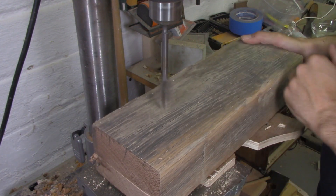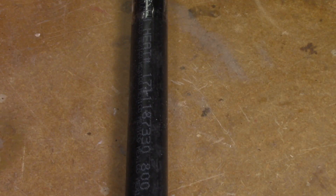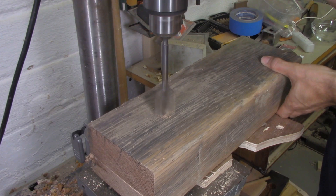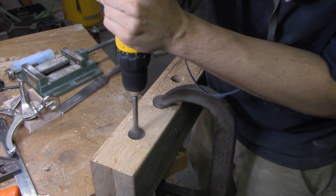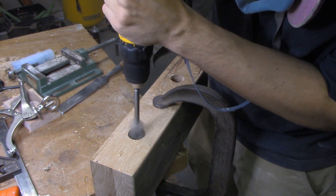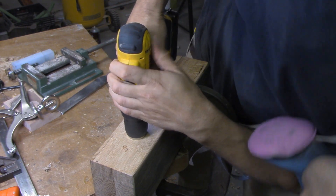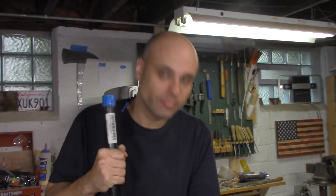Drilling out the holes for the blocks is kind of tricky. The outside diameter of the pipe is more than an inch and a quarter but a lot less than an inch and a half, so I don't have any drill bits that really work. I drill through with my inch and a quarter spade bit, then ream out the hole a little larger by rotating the bit in an orbiting pattern in a hand drill. Going really slowly in and out, over time the hole widens up and you can get a good fit. I've got concrete floors, so that's what I'm using to help drive things.